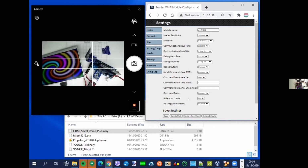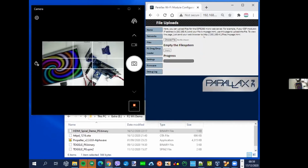And I think there was some UDP communication updates added as well. So now it's UDP capable as well as TCP. Those updates are included too. So I think there was a third thing, I just can't recall what it was. I think there was a bug fix because maybe you'll remember seeing this, Michael. There's a feature where people can drop files onto it, like what I was talking about earlier that Andy Lindsay did, like HTML, CSS, and JavaScript files that it will serve for you, but it would allow you to keep dropping more and more files until it overran its user file space and actually kind of bricked the module. And so you'd have to do a wired update to the firmware. I think that fix was included.